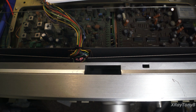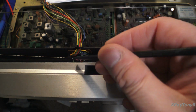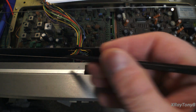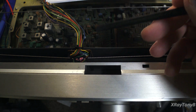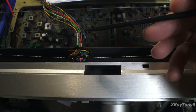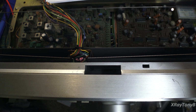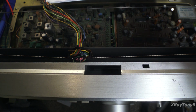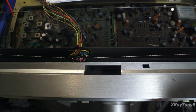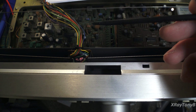So I'm sure if we wanted to reprint that little circuit board and redesign it and put the time into it, we could make the LEDs work. It wasn't the light from the LED that was the problem. It was the problem that the lights would not diffuse enough, even with a diffused bulb. I even tried scuffing them up even more with some sandpaper.